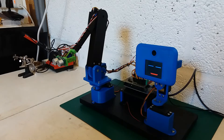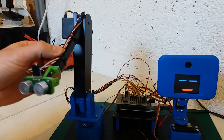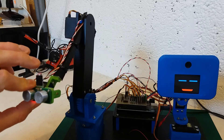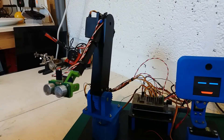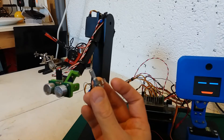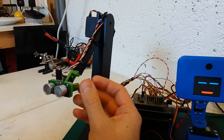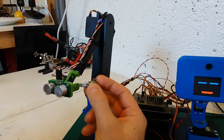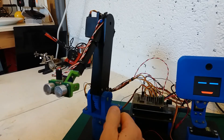As I said, I've made some good progress — I'm particularly pleased with the new end effector, or the new sensor on the end of the arm. The only thing it lacks at the moment is some position feedback. Having opened up one of these micro servos and looked at tapping into the internal potentiometer, it's a fiddly job and I'm worried the servo wouldn't survive. So there's a good chance I'm going to redesign this slightly to have a potentiometer externally mounted for position feedback, which might mean reprinting those parts.